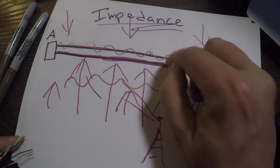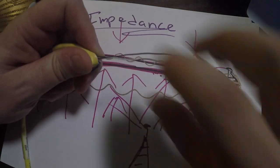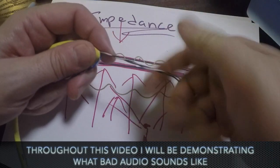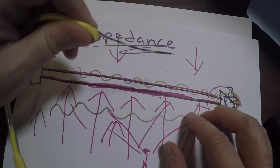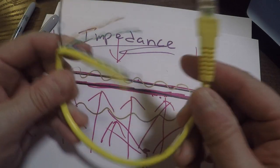Basically, all it means is we take our two wires, for instance these two wires that we have here, and we just twist them together. It's nothing more complicated than that. By doing this twist, you can see pretty clearly that now neither wire is closer to any other direction, so noise will hit the two wires at the same level, and the two wires will end up with the same amount of noise on them. When they get to our differential amplifier, the differential amplifier will cancel them out. And that's the whole point. Special thanks to our Cat 5 cable for giving up its life so you could see that.